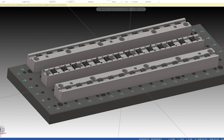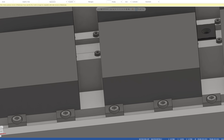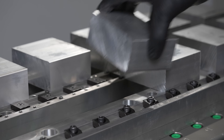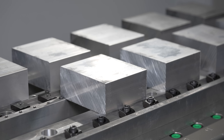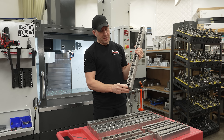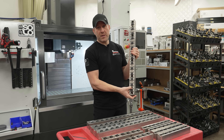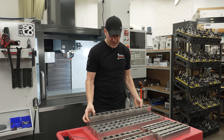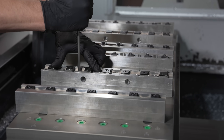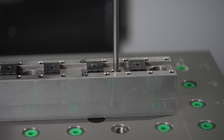Basically in my CAD, I know exactly where this is at and I just place the parts wherever I want. I've got one, two, three, four, five, six, seven - I can load 14 pieces on this of that size. This clamps to the table with the half inch 13 bolts and it's got half inch dowel pins right here. You set it on the table and the half inch dowel pins just go in. There are three of them and then you just bolt it down to the table so it's locked down solid.